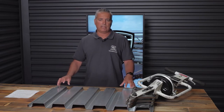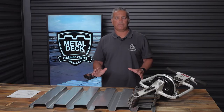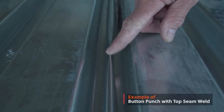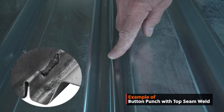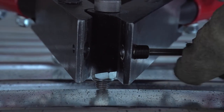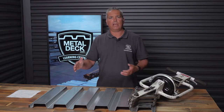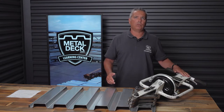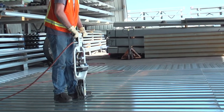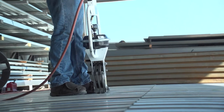It's really the evolution of metal decking that eliminated the need for top seam welding. Why would you use Punch Lock 2 metal decking? Two reasons: labor cost savings and material cost savings. In relation to labor cost savings, you don't have to top seam weld the material anymore. In the past with top seam welding, you'd have to crimp the sidelap together and then have a certified welder top seam all the material — very labor-intensive, very expensive. With a punch lock tool, you can take an untrained laborer and simply pull a trigger. You could punch lock a job probably five times faster than top seam welding, and at a much lower overall labor cost rate.